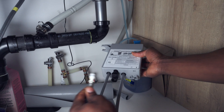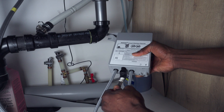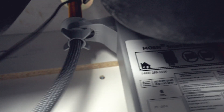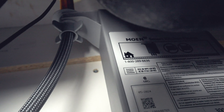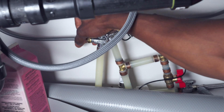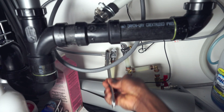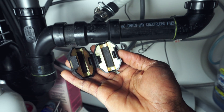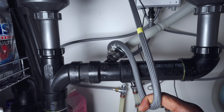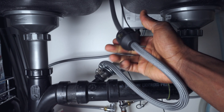We're going to connect the pull-down hose to the control box — it should just lock in place. Next, clip the control box right into position. Then connect the cold side to the cold line and add the counterweights to the spray hose. There is a line right there and it just clips into place.